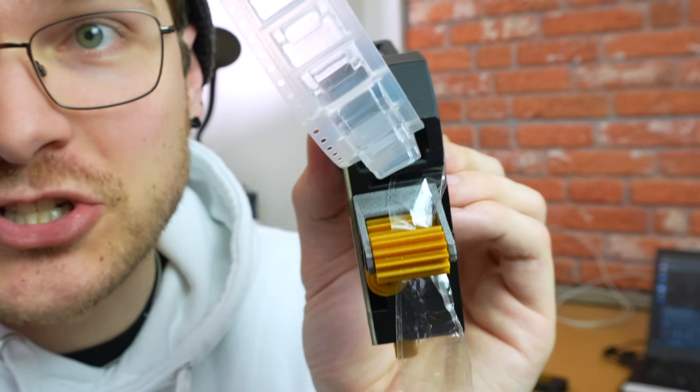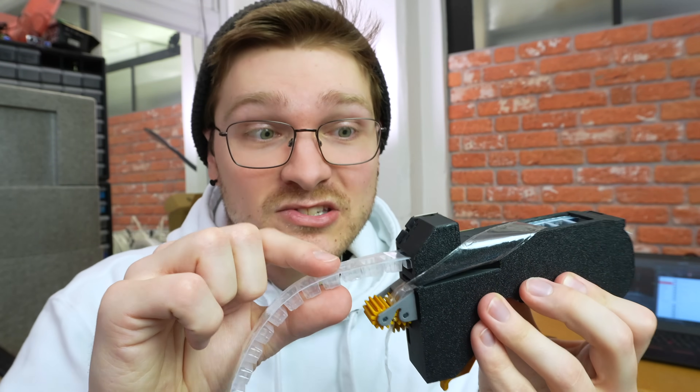This is the early prototype of a 24 millimeter feeder — you can see the film comes out and tries to wrap around, but it just does not work how it should. Sometimes that adhesive will stick onto the gears and it'll grab and won't properly feed. Also, 24 millimeter tape has deeper parts, so we have to wrap the film around a bigger channel to get to the peel gears. It's hard to get that geometry working consistently.